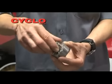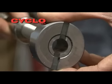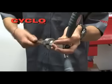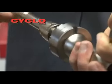Next, assemble the 51mm facer and 1 and 1 eighth inch reamer together. Pass the cutters over the shaft and butt up to the guide. Complete the upper assembly by threading the handle onto the shaft, aligning the keyways as the handles near the cutters.